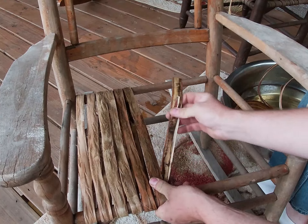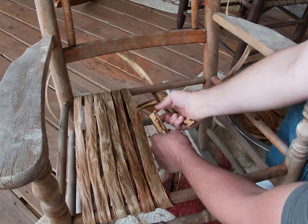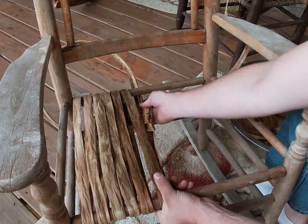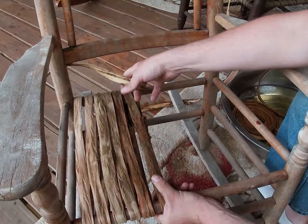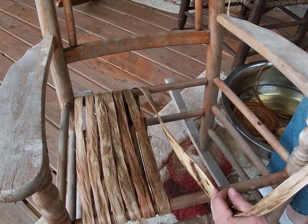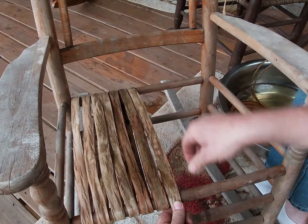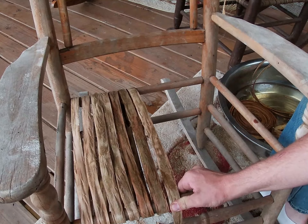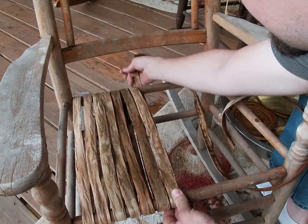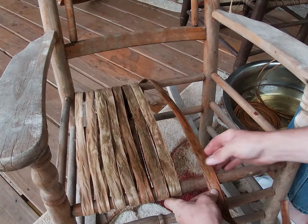I've got that one cut and ready to notch. Now I have seen a splice where they shave it down real thin at the end and then tie it, and that works — I've got a couple chairs done like that — but I like this way. I think this holds better and it's easier to do than trying to tie all that. We're almost halfway on this chair and I've got a big long piece soaking to finish it after this little piece. The color of this will totally change once it dries — it's still fairly green looking after you soak it, but it was pretty brown before I put it in the water. It'll dry a nice golden brown color. This strip has only been cut about a week so it's still pretty fresh.